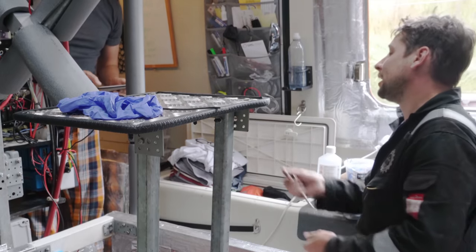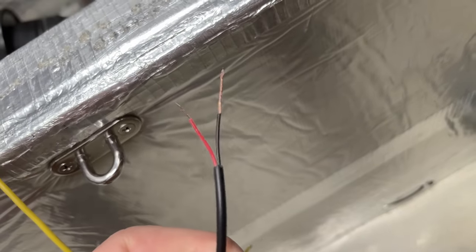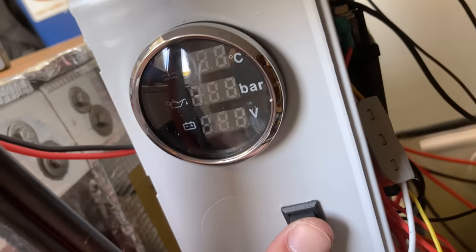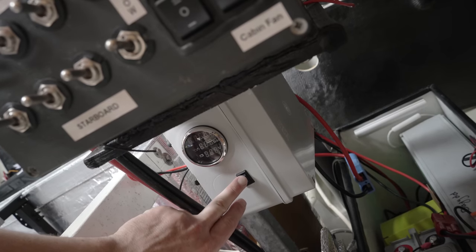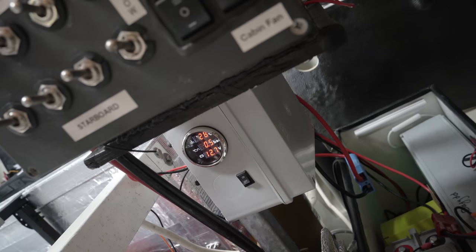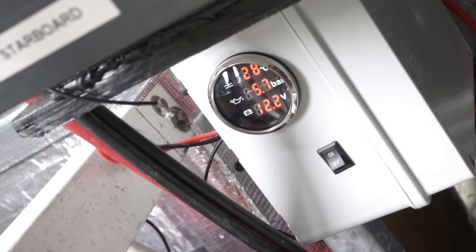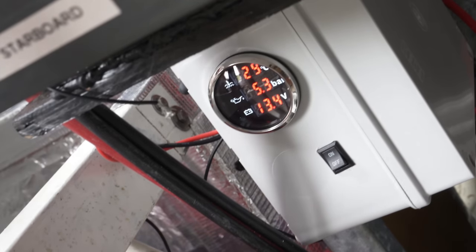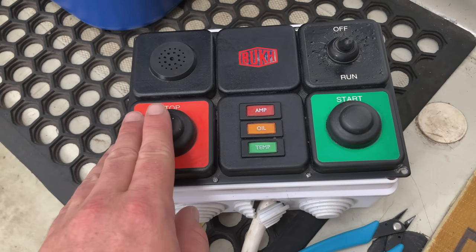This latest elephant has been escorted quietly and calmly out of one of the larger hatches. I can now complete the assembly. The oil and water wires carry precious little current, so I found some thin dual-core to send their information aft, routing and tying them carefully to the main electrical loom. Tested success - the engine is off so the water is at residual temperature from the last test and the oil is not pressurized. Despite the oil and water sensors being the originals from Alan's 2007 build, the alarms have never played up. About five bar of oil pressure, the water slowly warmed up, and the voltage quickly ranked up to about 14 volts. My fear that I'd blown an alternator diode in a previous careless no-load test run was unfounded.